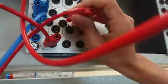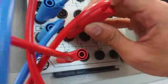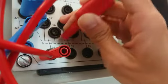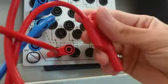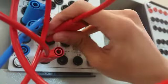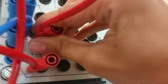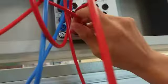Here. This is the normally closed for branch number 3. Okay, this is not normally closed, normally open. I'm sorry, normally open for branch number 3 from power supply. Okay, this wire came from power supply over here. This will connect to the normally open for branch number 3. And okay, back to the common. It outputs from the common back to the lamp.